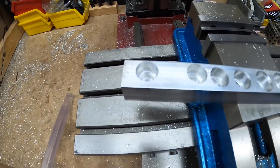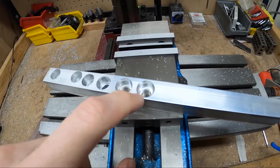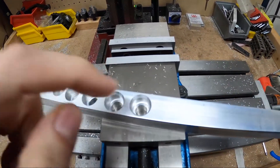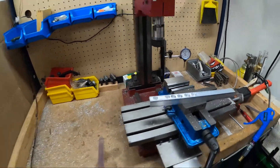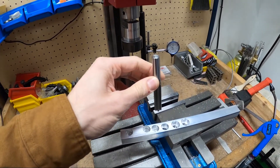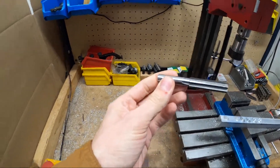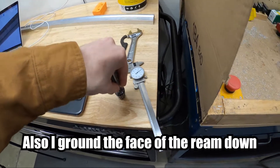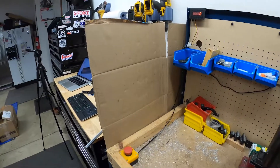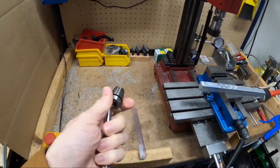You can see the progression of my cuts — as time goes on the surface finish is improving and I'm adding the chamfer now. But I need to go a little bit smaller on the chamfer because it left a burr on the boundary between the bore and the chamfer — definitely don't want that for the O-ring when I'm putting fuel injectors in. The other issue was the ream was still too long so I cut another inch off — it still fits inside the collet and gets a good grip. Also added a cardboard chip deflector to keep the workbench cleaner.